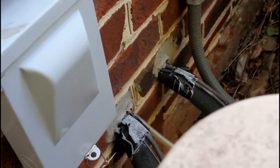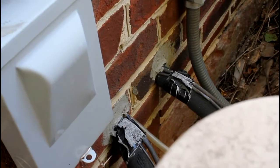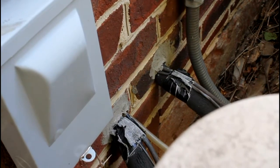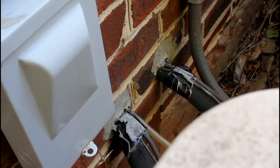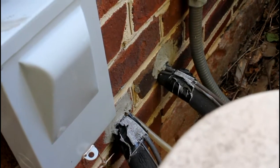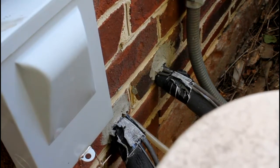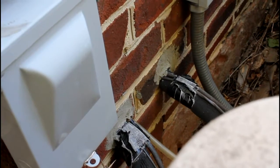Here we're looking at where the air conditioning lines come in. There are actually two units — this house has a heat pump on the top floor and an air conditioner/heat pump in the attic, and an air conditioner down in the basement. You're seeing a sloppy job by the builders and installers, with a little bit of concrete thrown around those. These would be worth a closer look for air infiltration and getting inside the pocket of the house.